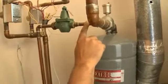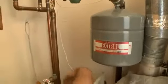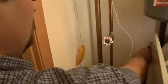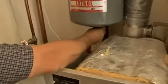And it's a chain reaction. Then we add more water, and when it shuts down and cools off, it heats up, it gets to a high pressure, and we just keep running new raw water through this over and over. And in this case, the drain for the relief valve is down in the crawl space. So you really wouldn't know if it was occurring. It would be nice if the drain for the relief valve went into a pan and then you could see when that happens. That would be a better way of having it than the way it is.